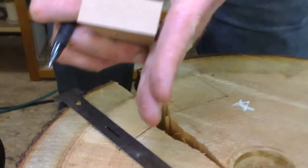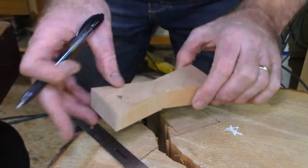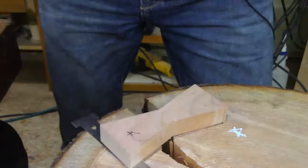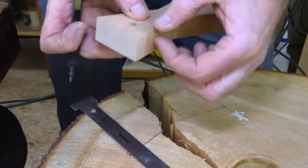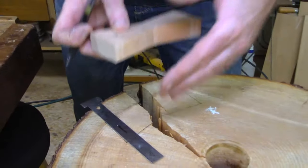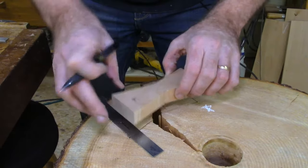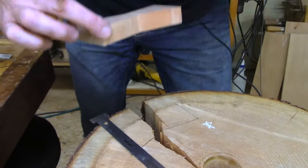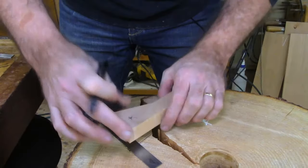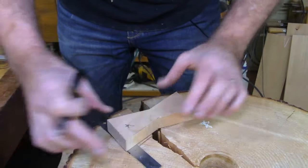if you angled this whole side, like a couple degrees or a degree, when you put it down and you knife around it, then when you go to slam it in, it may not want to go the full thickness because you're going to be thicker out here. By the time you jam it in, you really only marked the narrower profile if you're going to be sloping this in. So at the end, I might break this edge just to help it get started, but I don't think we'll need to.